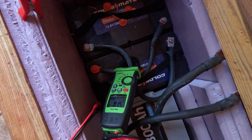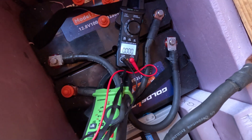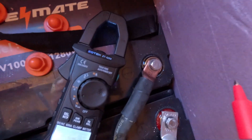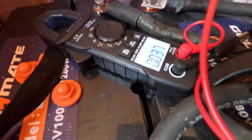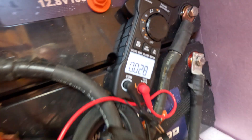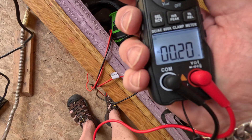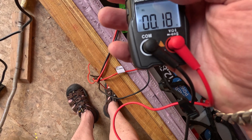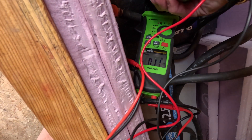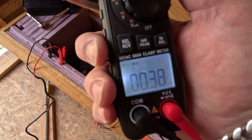I'm balancing these two batteries down here using the expensive KPS meter, but what if you only need this meter for a solar system? Checking the first battery: 13.43 volts. They're in parallel so they'll be connected. Let's measure the current — I'll hit relative to zero that out, come down here, hit hold and pull it out: 0.38 amps, so they're almost balanced.